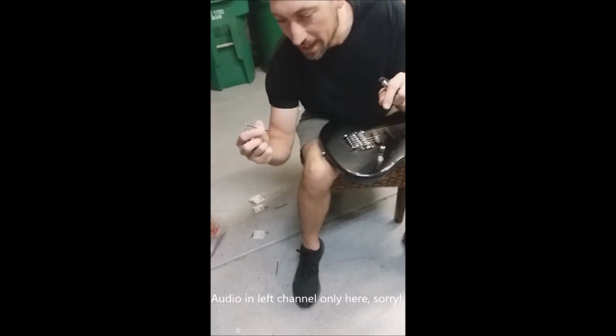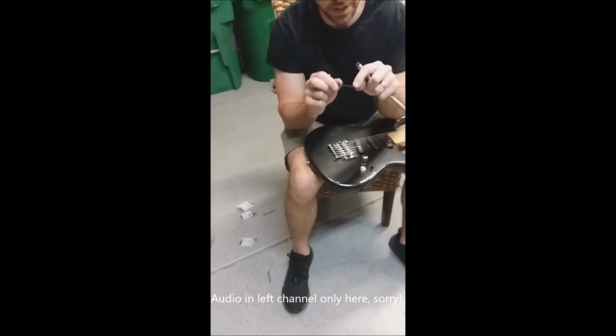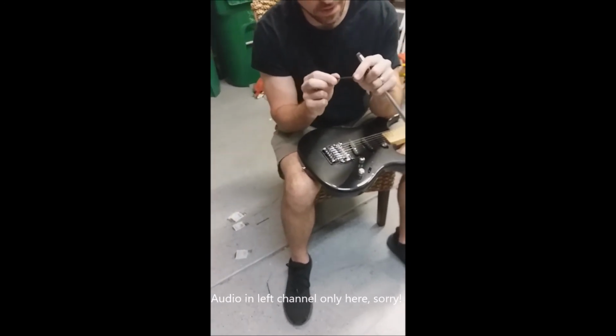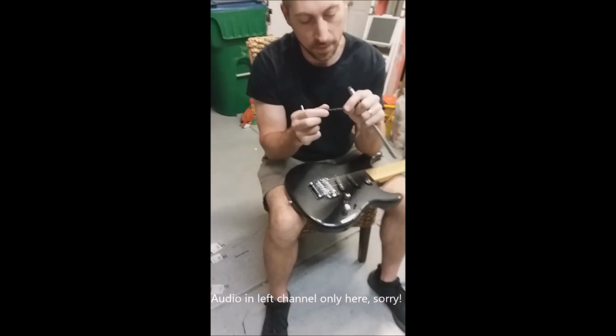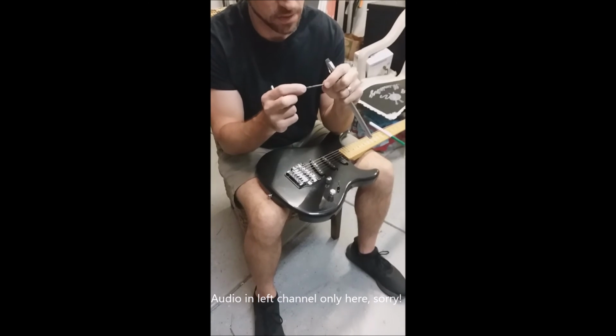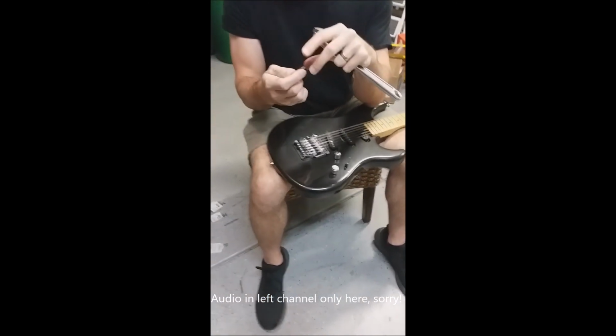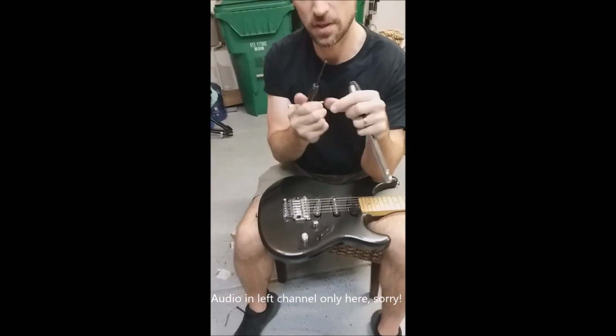if you're going to be using the 10-32, you need a number 21 drill. So over here on my drill, this came in the same set. This says 21. This is a 25. Where'd my 21 go? You want to make sure it's a 21. You want to make sure it's the right one. So this is my 21. You put your 21 in here. Okay, you shove it all the way down. You tighten this on there really tight.